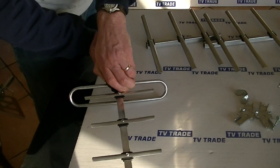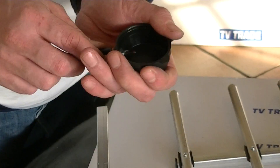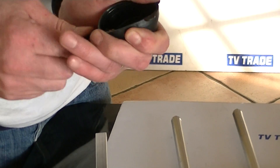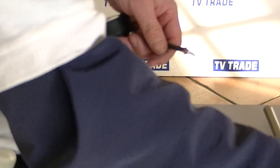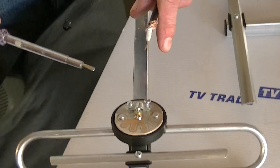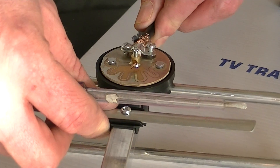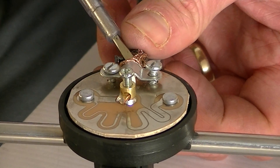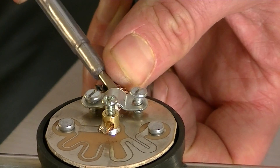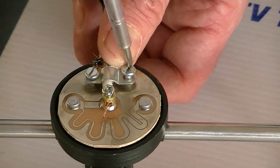The very first thing I'm going to do is remove this plastic cover here, grab this length of cable, shove it through this hole here, and rotate it repeatedly to pull it all the way through. I want to simply feed this cable through — this is the core cable here and these are the earth cables here. The idea is that each has to independently get a good connection but not be touching each other, so I lock this in with the flathead screwdriver.